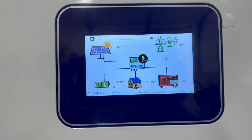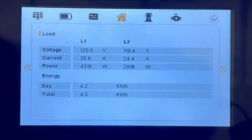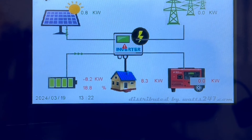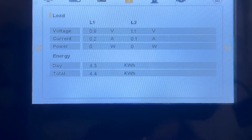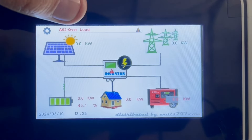I'm going to turn the electric range on and a couple other items to see what we can get up to. I don't have sound canceling on the mic now so you guys can hear this at full capacity. That's got us up to close to 5,000 — 7,000 watts. We're at 7,000 now. I can see 4,000 and 2,000-something on each leg, depending on where it's going. 8,500 watts. 11,000 watts — 11.3. So we are cycling over the rated wattage. And there it goes — it kicked out. You can see the overload warning there.